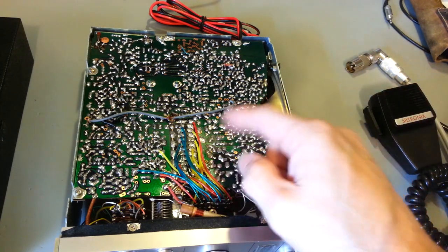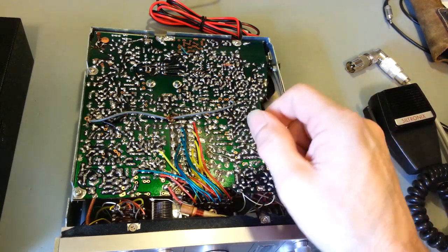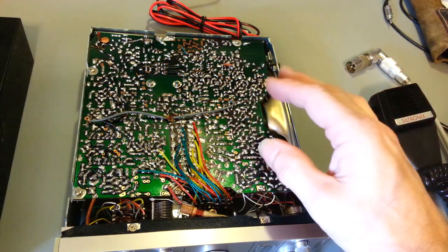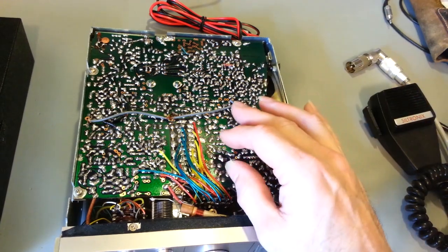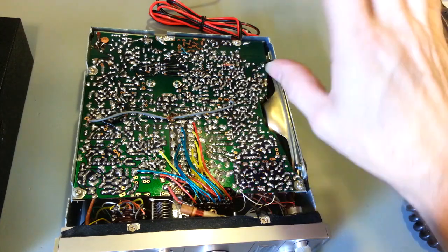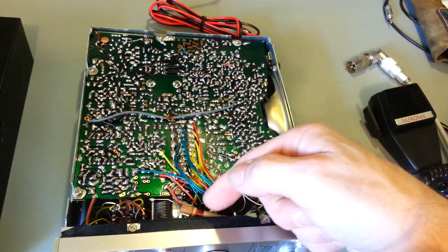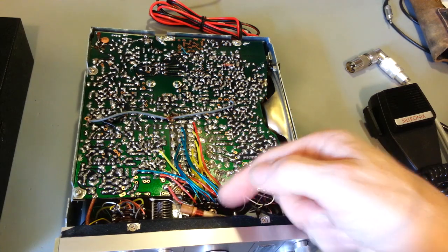Just tune this coil. What I'd suggest is pick any of the adjustments. Whatever channel, if you're on channel 1 on TPA, and it tells you to adjust whichever the VR or VC, variable capacitor 300 and whatever, put that trimmer capacitor in the center of its range. Your frequency is going to be way off if you're looking at your frequency counter. That's fine. But put that variable trimmer cap in the center of its range, and then adjust this adjustable coil here, and you'll tune that.